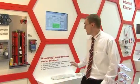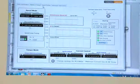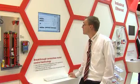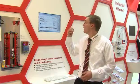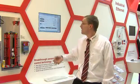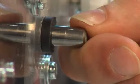Now you see the identification process is finished and we can go to a different slide on the GUI. Here we do speed and torque control. I run the motor now — it takes a little bit of time to recalibrate the offset and also recalibrate the resistance, and after that you see the motor is starting. You can see the torque control of the motor — I cannot hold it, it's still turning.